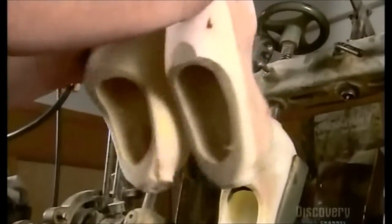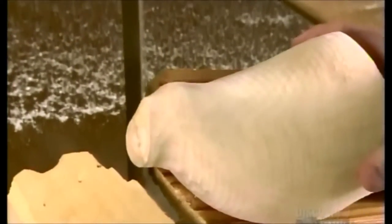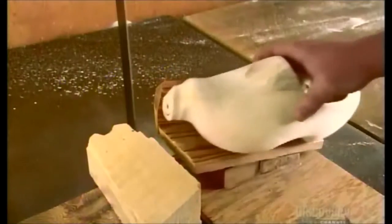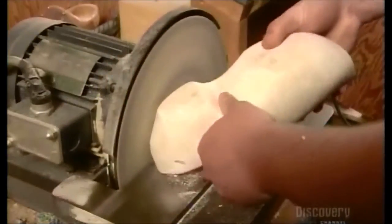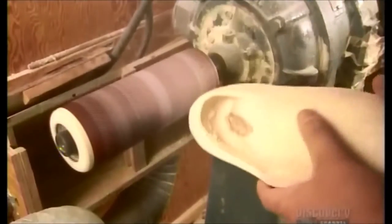Then workers employ a very high-tech maneuver to remove the wood chips. They lay the shoes on racks to dry out the wood, then cut off the knobs at the toe with a bandsaw, while inspecting for flaws that may have come out during the drying phase. A disc sander grinds down the knob on the heel and refines the shape of the toe. They work with a barrel sander to smooth out the opening, then switch to a balloon sander. The air-filled rubber sack inside flexes to the shape of the shoe as it sands.